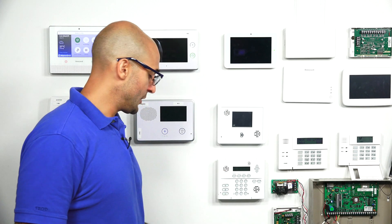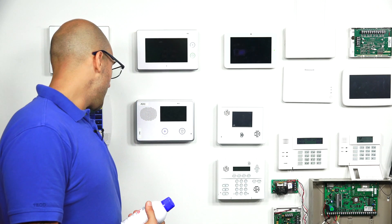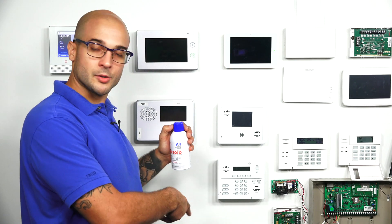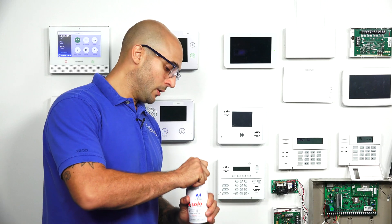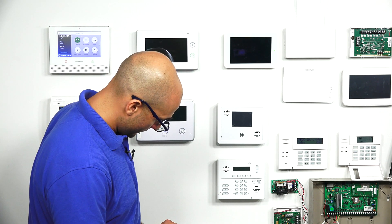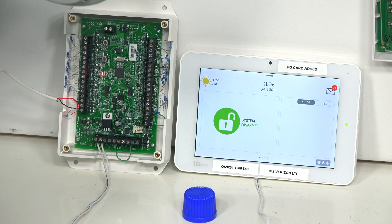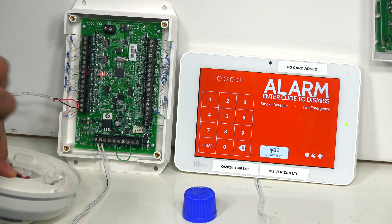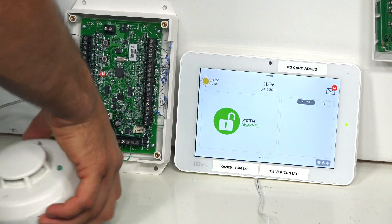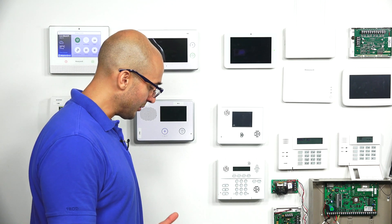Now we can test our smoke to make sure it works. You can use the Test button on the smoke, but it's not a true test of the smoke detector, as it's not actually testing it with smoke. The recommended way is to purchase a can of canned smoke — smoke in a can — and blow it right into your smoke detector to simulate a real fire. So I take my smoke detector and blow canned smoke in it. We've got the alarm, and the power reset did occur, which turned the smoke detector off, showing that we did reprogram it successfully to the system.